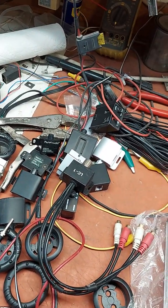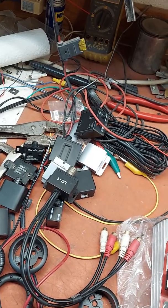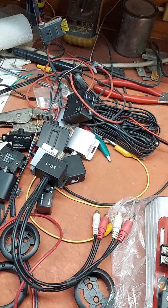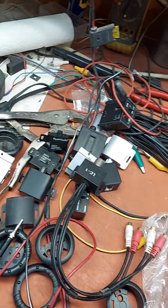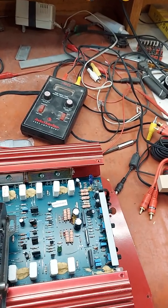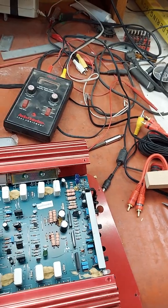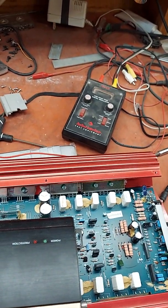You've got to understand their numbers. They're making that measurement from a certain impedance — just like an amplifier plays into a certain impedance and you get a certain output in watts. So when they say that they do a 4-volt pre-amp output, look at what the output impedance is at the load. Typically it's anywhere from 50 to 100 ohms, which is nowhere near what your amplifier input is. So yes, it does do a 4-volt pre-out, but that's only at a 100-ohm load.